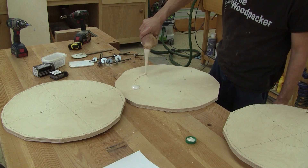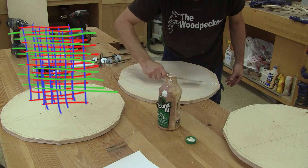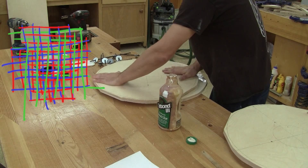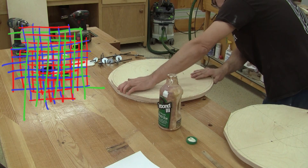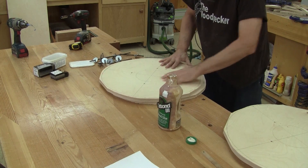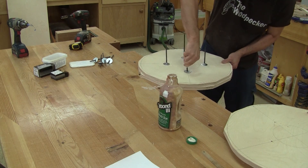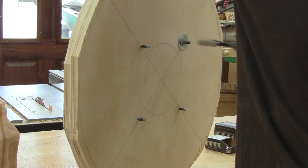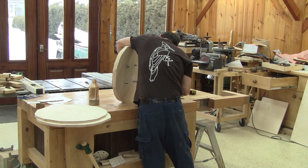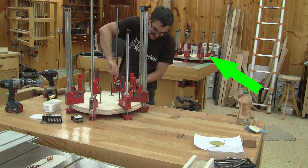Now I can glue the pieces two by two. When I glue two pieces of plywood together, I always glue them with the wood grain in the same direction. This way, I end up still having an odd number of plies. If I would have glued the plywood perpendicular to each other, I would have had an even number of plies. In the end, twenty-nine or thirty plies would not have been a big deal, but I always glue plywood like that. When the glue is spread evenly, I insert some threaded rods into the clamping holes and make sure they apply a good clamping pressure. Then I put eight clamps around each glue-up and leave them to dry.